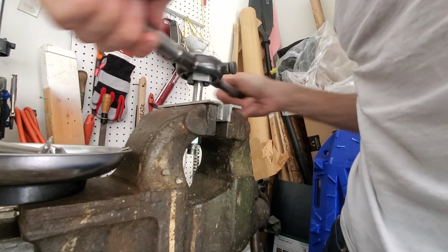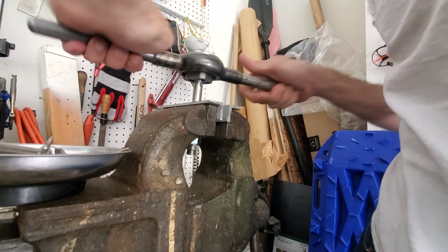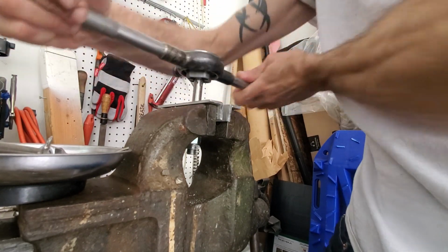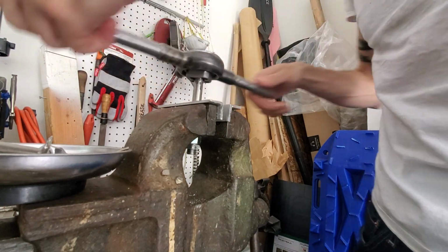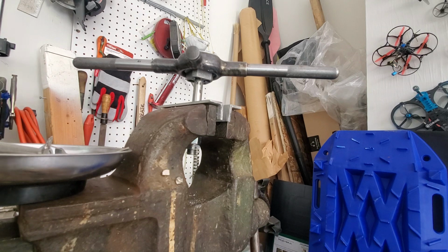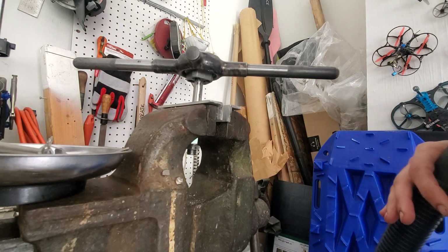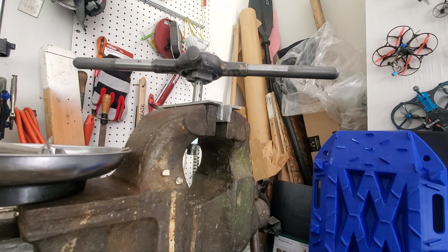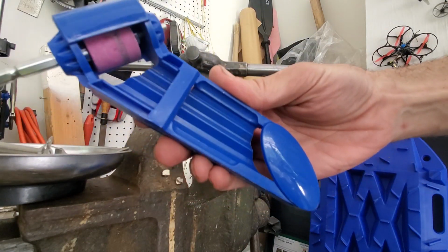Don't want to botch the last one. I'm getting so close. I'll tell you what, I had a hellish time drilling the 2.5 millimeter. Last night's couple of holes went way better. Let me vacuum this. And now my 2.5 cobalt drill bit is getting a little bit dull. And I have the sharpener. Kind of sucks, but it sort of does it.